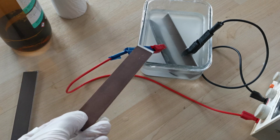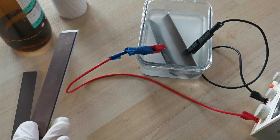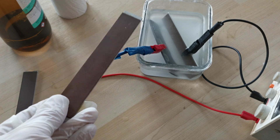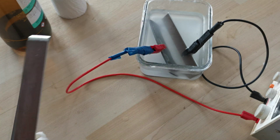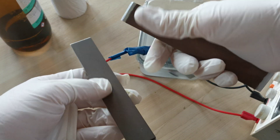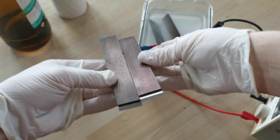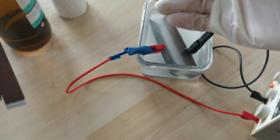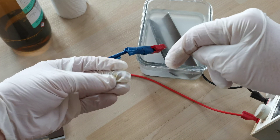This will only work with metallic bound stones. It will not work with resin bound stones, simply because you're using electricity and resin is non-electrically conductive. So you can only do this with metallic bound CBN or diamond stones such as these — these are CBN. If you use these, you have probably noticed that they clog up and get less aggressive. This one is non-treated, on this one I have already started — you can see there's a notable difference. This one is almost done, and you can already see some copper here coming off. These are copper bound.